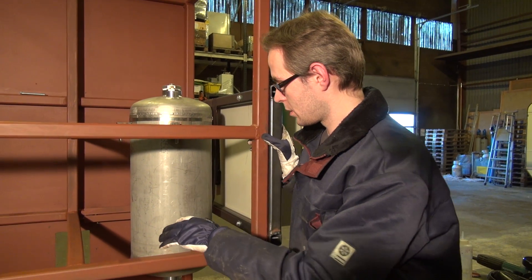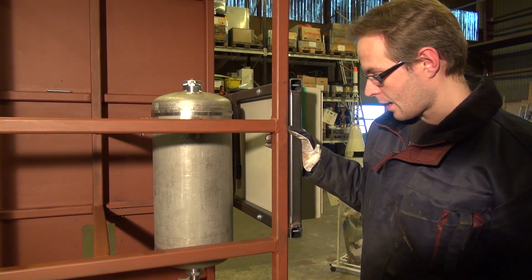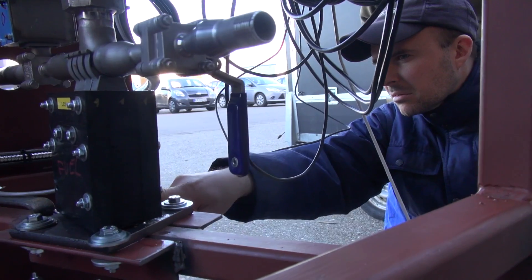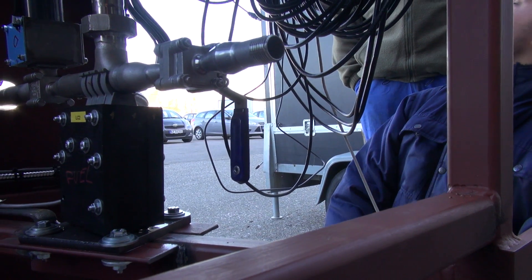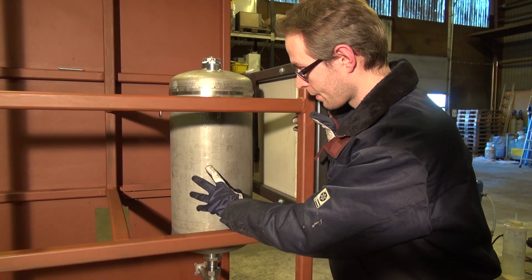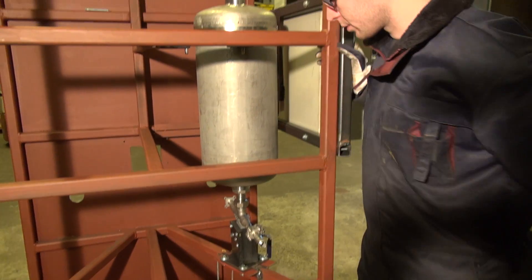This is the fuel tank and over here we have the LOX tank. You can see the tank is fitted onto a load cell which is hidden beneath this thermo-insulating plastic. The tank will, when it's full of liquid oxygen, be cold, so we have isolated the load cell with this thermoplastic.